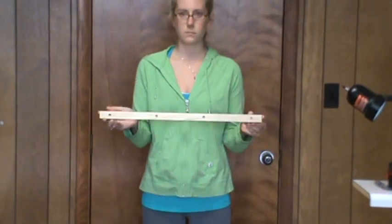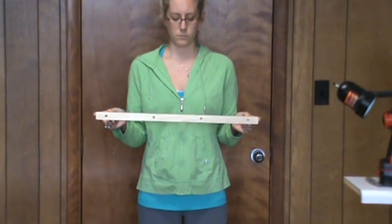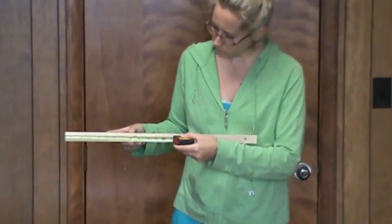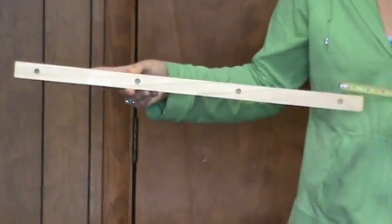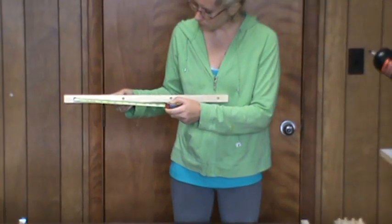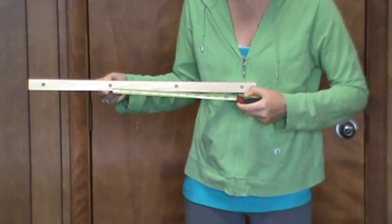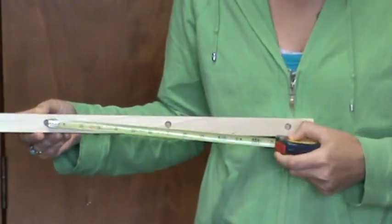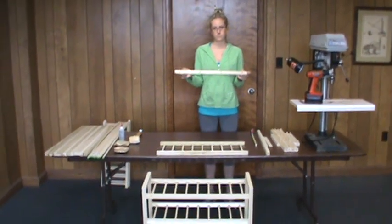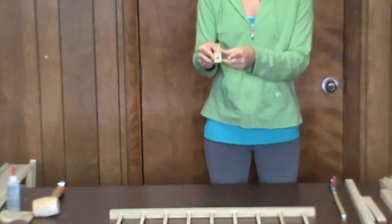To cut and drill the legs, take 4 1 inch by 36 inch squares and cut to 24 inches. Mark 1.5 inches from each end and drill 3/8 inch holes 3/4 inches deep. Measure from one of those holes and drill 2 more identical holes 7 inches on center. You will have 4 3/8 inch holes on this side. Now center a 3/8 inch hole on one end about 1 3/8 inches deep as before.